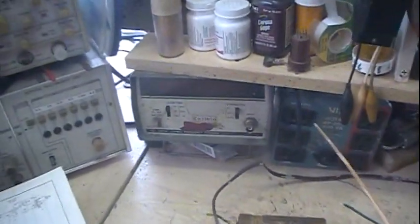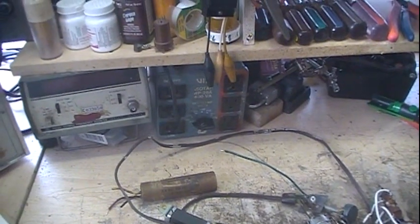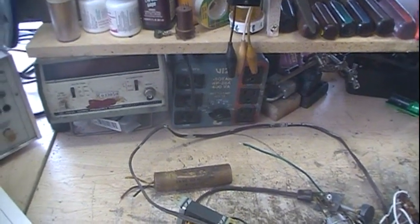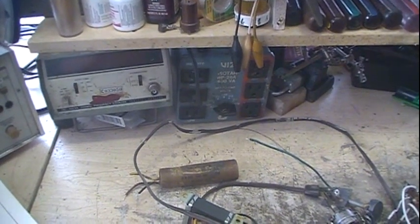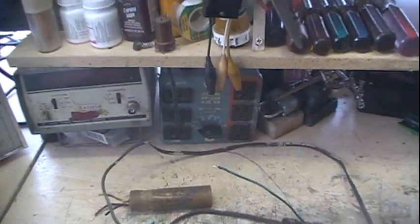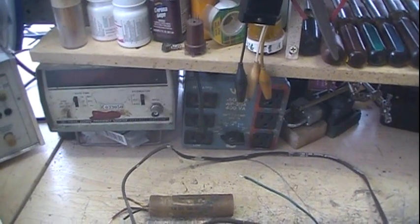So that's why I really didn't go over the actual resistances of the windings — it's not really going to give you a lot of information anyway. If you take an isolation transformer or any transformer and measure resistances, unless you have a service information reference that tells you what the primary and secondary should measure, that's the only time DC resistance can give you really good information. If you work with enough power transformers, radios, and TVs, you get a feel for the average primary resistance, high-voltage secondary resistance, filament winding resistances, and so on — so you know maybe the transformer is fine. Since I don't have actual service information — just a schematic with no resistances on it — if it seems to work fine and it's not getting hot, that's a good sign. If there was a short in the windings, it would either show up in the voltages being off or in the transformer getting hot fairly quickly.